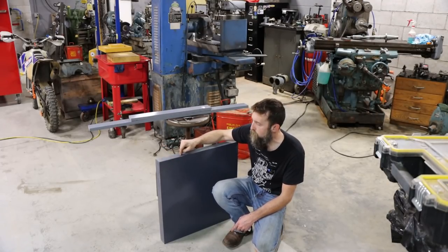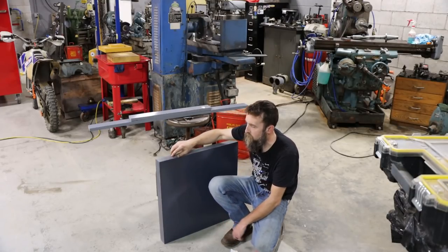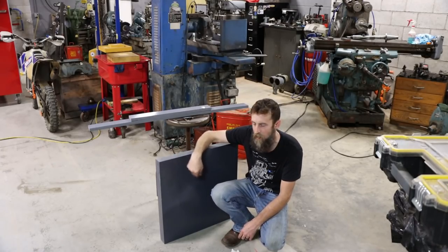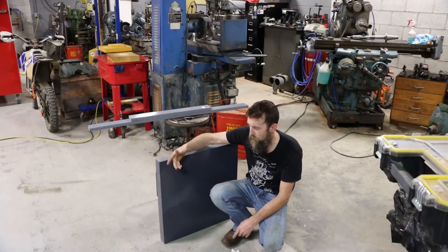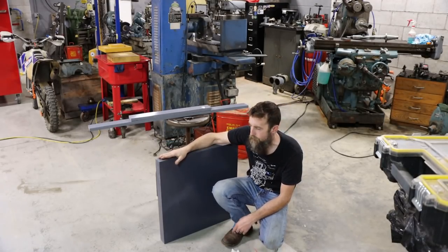Now what I need to do with this is cut 2 strips that are 8 inches wide out of this. And I'd like to do it one and done, not cut it in the bandsaw and then have a secondary op to clean up that ragged cut. What I'm hoping is that I can take this over to the K&T mill, use some spray mist coolant, a slow speed cutter, and just get a nice finished cut out of this and be done.